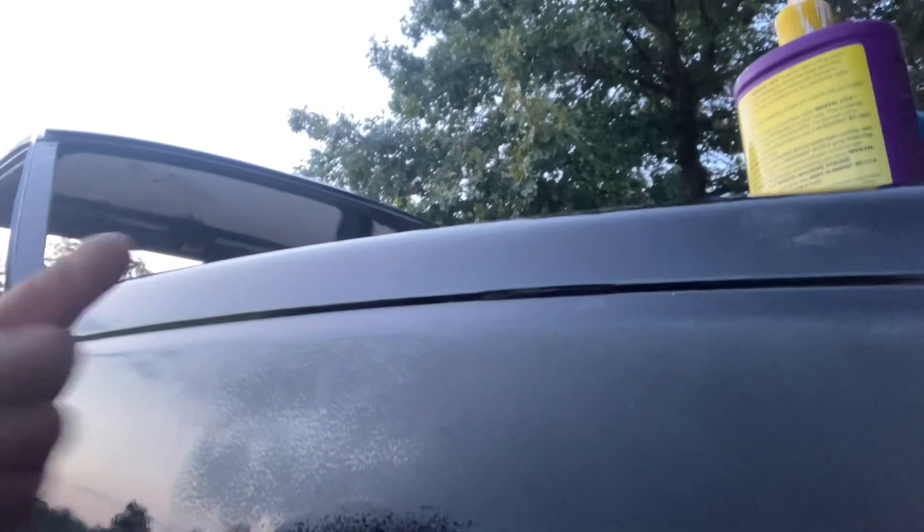You can see we've got a real nice even dull finish now. I've got a little foam interface pad on this so it's not going to be perfectly flat, and that's good — I don't want it perfectly flat. Where those little dust specks were, you can still kind of see a tiny shiny spot around where one was, but it got sanded out. This dull finish is what you're after — quit right when you get there.